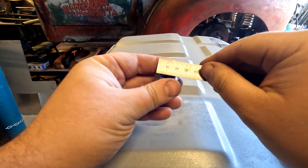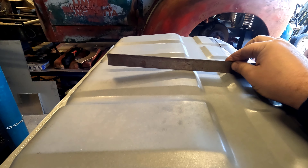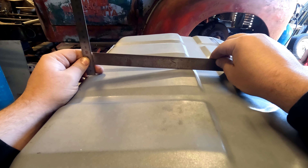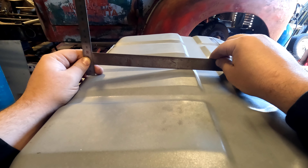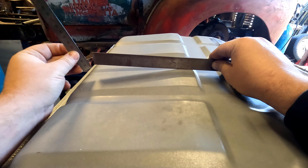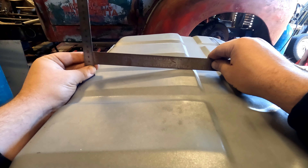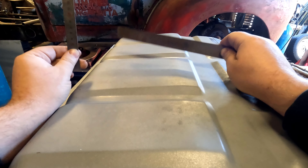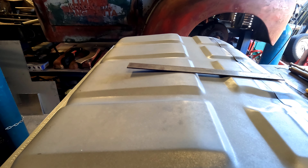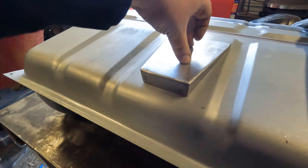What we're going to do is take a measurement — 25mm. Realistically the sump should be 25mm. I know that the right-hand side is my bottom so it is flat. We'll measure to where 25mm is on the square — so I now know our sump needs to be that long and that deep. I'll grab the better ruler and confirm that's 165mm long and 25mm tall, and we'll just make it 100mm wide. We'll cut a hole in the tank. From those measurements we've made up our little sump box.